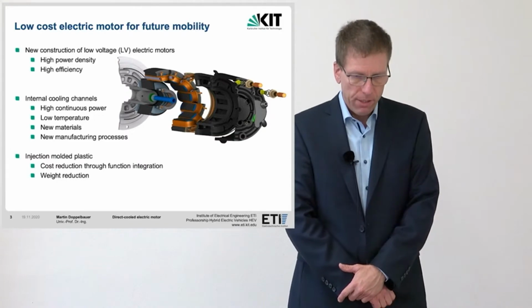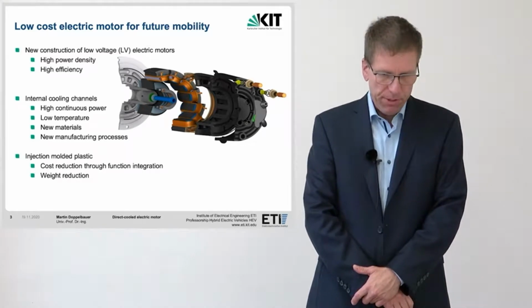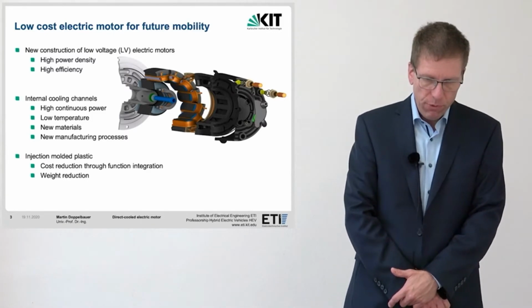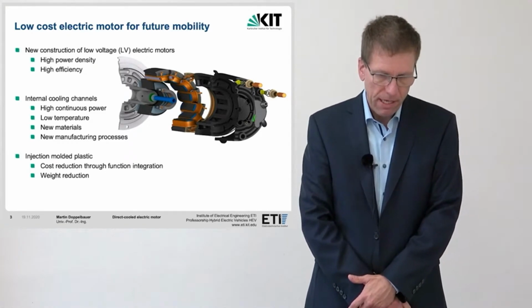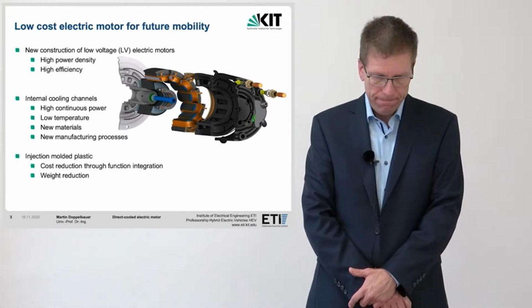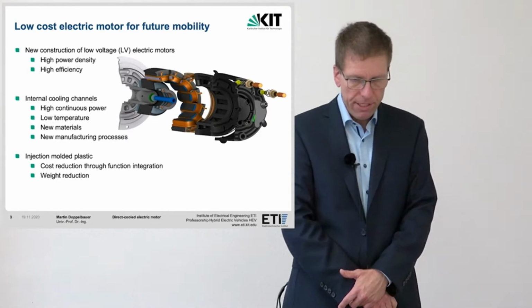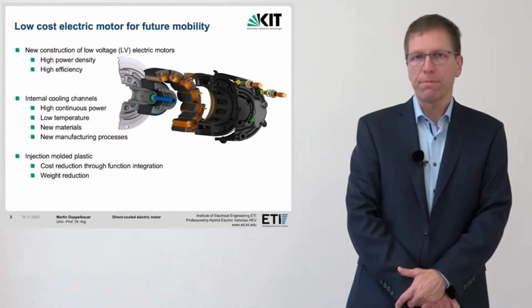The purpose of the project was the design of a new type of low-voltage electric motor for traction vehicles. We were specifically looking for high power density, high efficiency and low production costs. The aim was achieved by removing the outer cooling sleeve and introducing cooling channels directly into the slots. As we no longer have to rely on thermal conductivity of the outer housing, we could get rid of the two-part metal housing and use plastic mold instead. This reduces both weight and cost. Furthermore, we were able to integrate the necessary plugs directly into the mold to reduce costs even further.